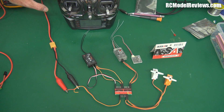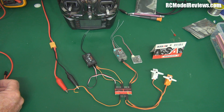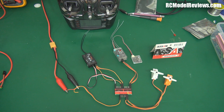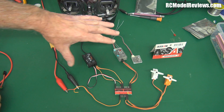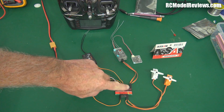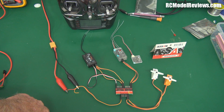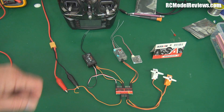Down to 2.5 volts — actually, both receivers have stopped at 2.6 volts: the X8R and the JR have both stopped. Winding back up — there we go, right on the verge at 2.8 volts. At 2.9 volts, everything is working just fine. Switching over to the JR — also working. So this unit is not going to be the weak link. In a low voltage situation, it looks like it keeps going even after the receivers have browned out — or fails at the same time as them. Brilliant.